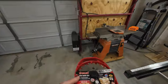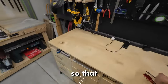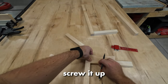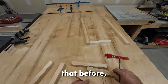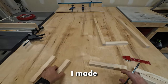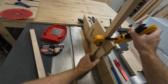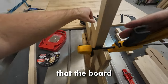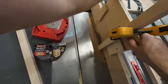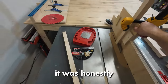After putting away my DeWalt planer, I grabbed my dado blades because what I'm planning on doing is making a groove on each of the boards so that I can glue them up. Here I'm actually starting to mark them out so that I don't screw it up and do the wrong side when I run it through the table saw — I've done that before and I didn't really want to waste this maple. One of the cuts required making a groove on these long 24-inch pieces with the board sticking straight up from the table saw. I have a really simple jig that I made to hold the board in place as I move it through the blade — this would be an impossible cut without it, but with it, it was honestly fairly easy.